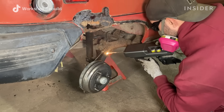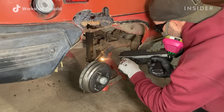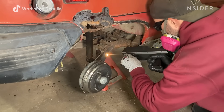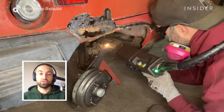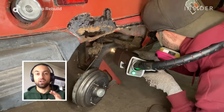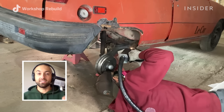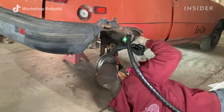With any laser cleaning machine, this is a beam of light and it also creates a lot of heat. You can damage the surface substrate, which is the metal. So you always want to keep your tool or handheld gun in motion. You do not want to keep it too long in one certain area or on one spot, because you can damage the metal if you keep it there for too long.